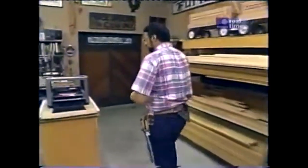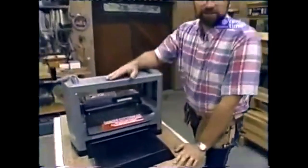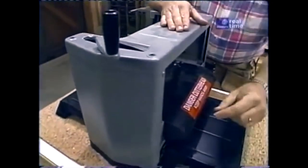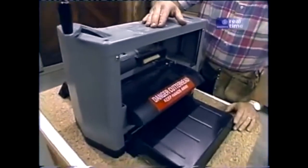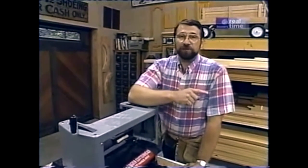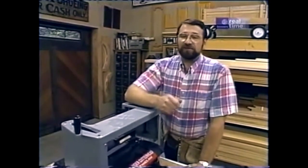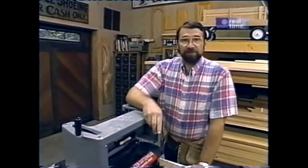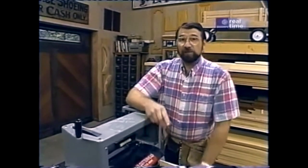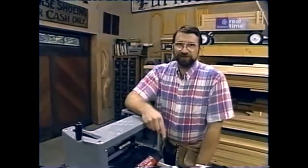I did need one critical tool — this planer, it's a surface planer. It has a heavy wheel with a couple of long knives that will clean the surface of the boards up and make them nice and smooth. When you're planing that kind of wood there's grit in it, and even if you remove the nails you're going to have some damage to the knives, so you have to replace the set as I did this morning. But be careful — I nicked my finger doing that job.